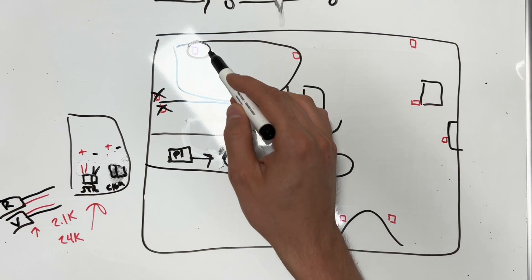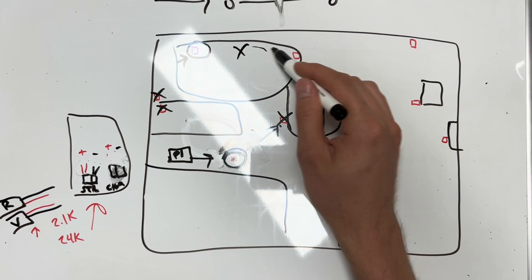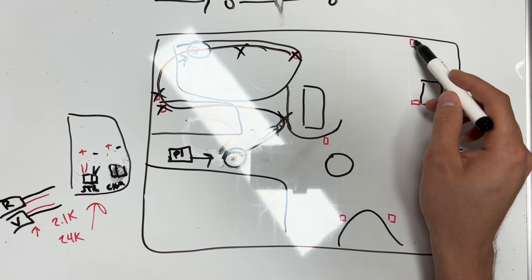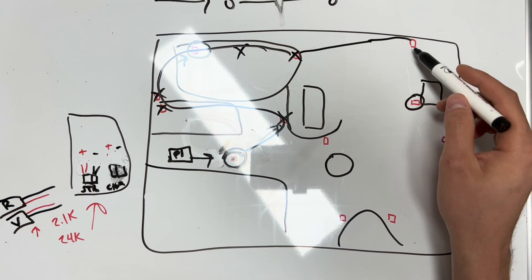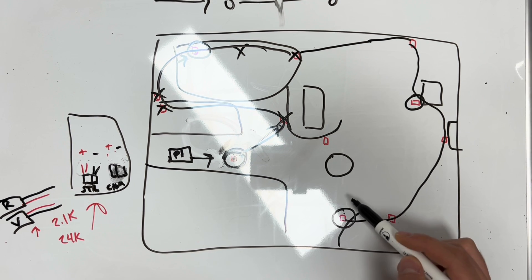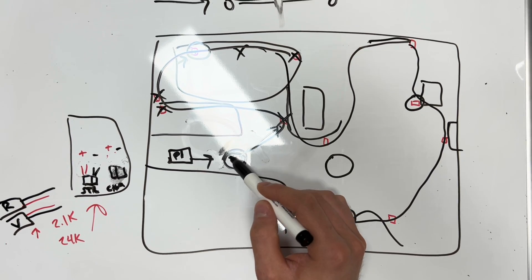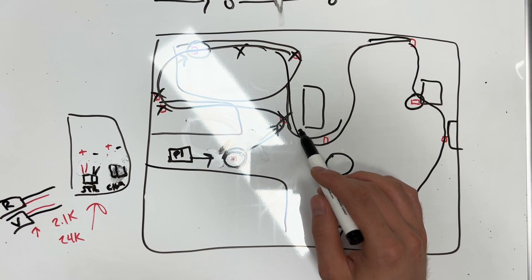After hours of opening up random boxes — checking one, maybe it's down here, still had signal on the incoming side, disconnecting and finding the next box had no signal — we traced which direction the signal was coming from. By the end we found the direction of the wire going around the building and found the end-of-line resistor by process of elimination. The home run was on one side, and by opening boxes and disconnecting wires at the back through trial and error, we finally got it.